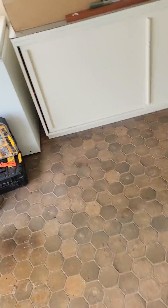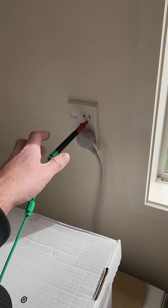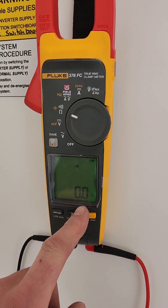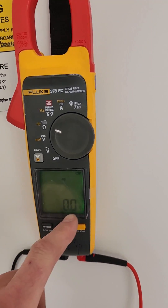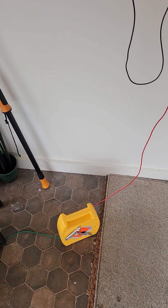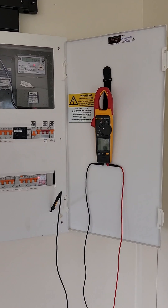This is spooled out ready for them on the roof, but just for now we'll test it to a hot point. You can hear it beeping — my meter will bell out, the screen goes green, and 0.00 means it is lower than 0.1 of an ohm. Pretty easy to do earth tests, but I think it's something people either overlook sometimes or get confused about how to hook it up — so there it is in its practical form.